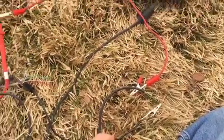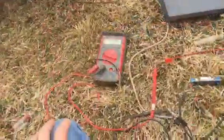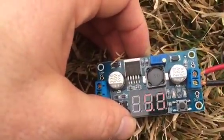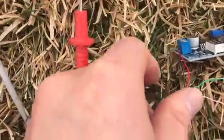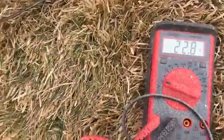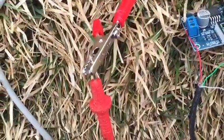This connection I'm actually going to run into here and test my output — hopefully it should be 12 volts. Here's the setup: you can't see this hardly at all because it's so bright outside, but that's a reading of five volts in, coming off of All Power. The USB connection is coming in here, and outbound right now is 22 volts. There's actually an adjustment on here where you can adjust the output voltage.